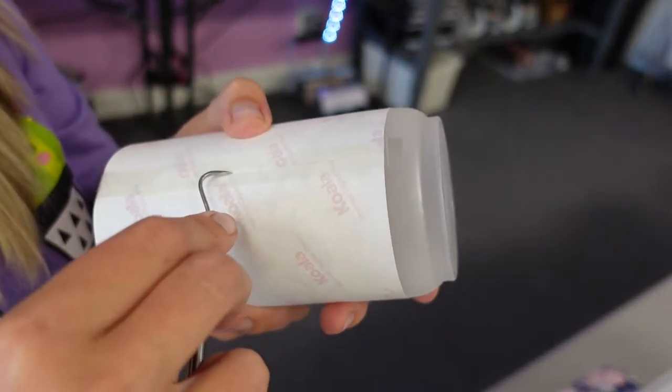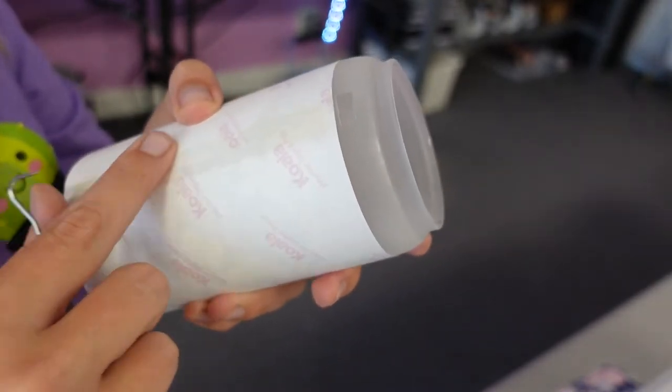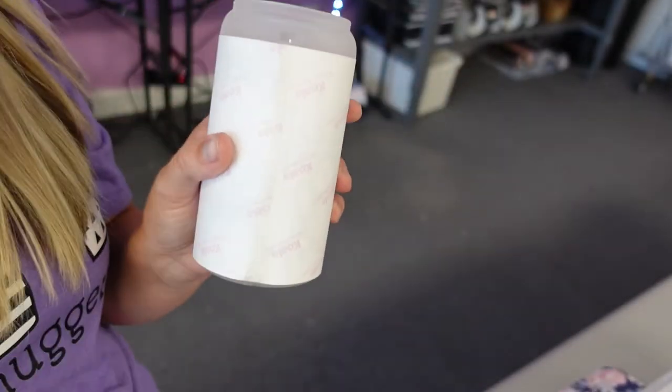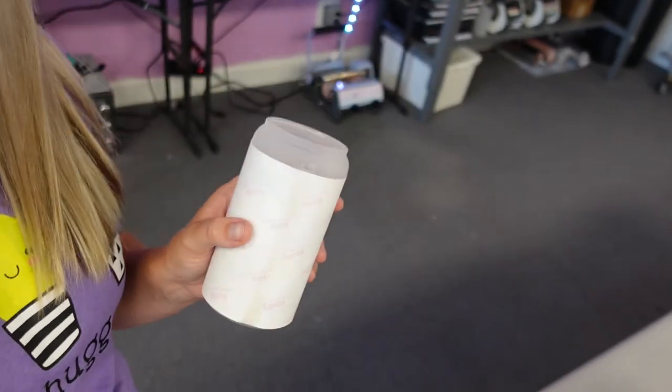You're going to push down and come right down that seam to get all that air out. I can almost see the paper bubbling a little bit as you get all that air out of the seam. This is true with any product — getting all of that air out of the seam is what's going to make sure you don't have any blowout or ghosting.